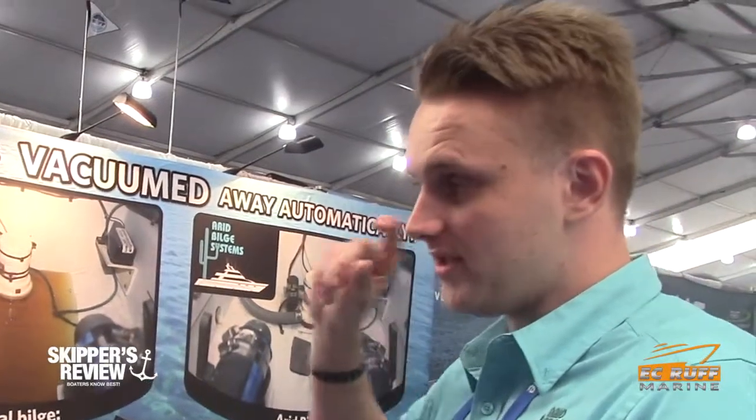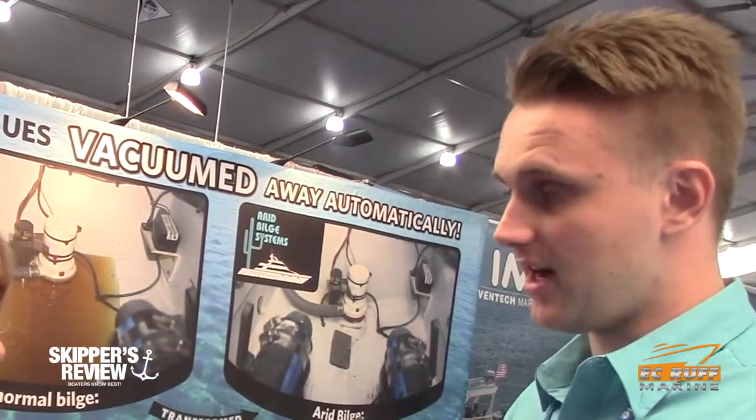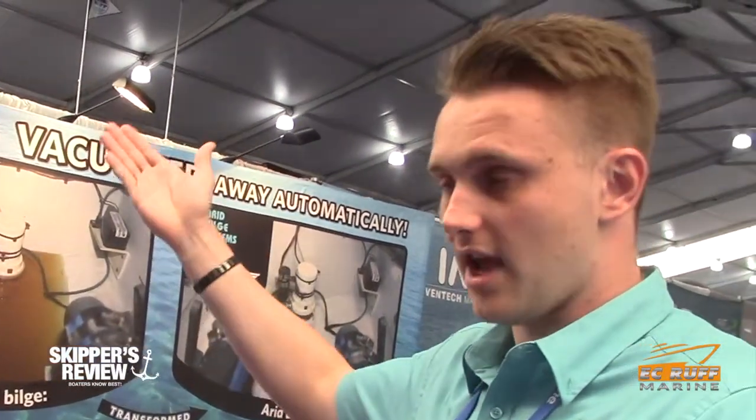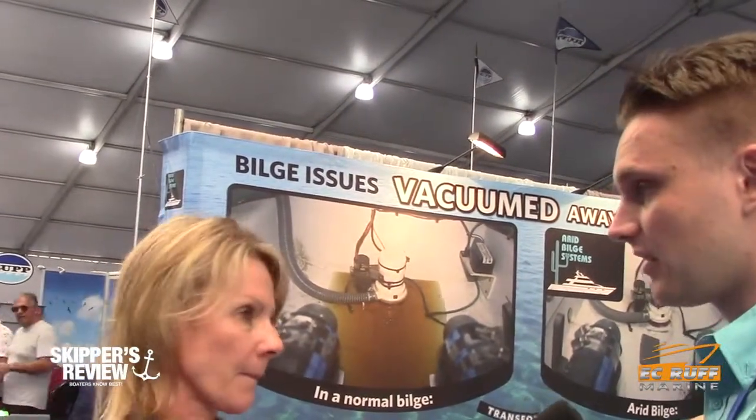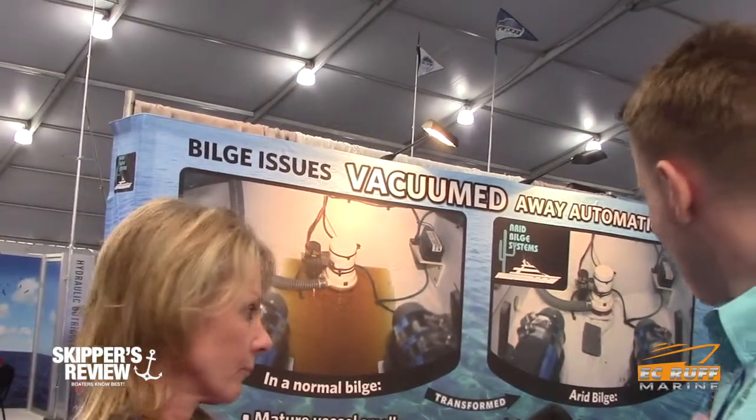Oil is lighter than water, so the oil will be sitting on top while the fluid goes out via gravity feed. We also offer the eco-alarm system, which is a probe we put inside of the eco-friendly reservoir, and it sends an alarm to the owner, captain, and crew. If you have a big oil spill in the engine room, our system sucks it right up. Instead of going overboard, it goes to the eco-friendly reservoir and alerts you to stop immediately and go down to the bilge. Our zones are all labeled — you go back to the affected zone and find a clean trail right back to the source.